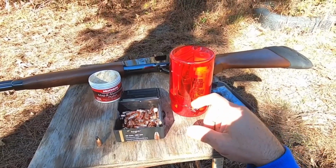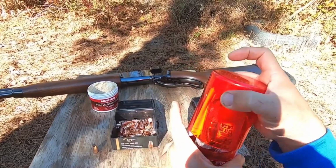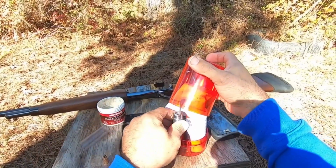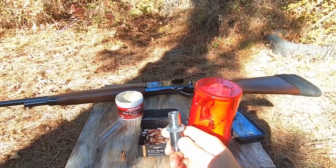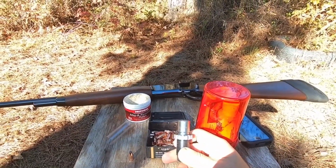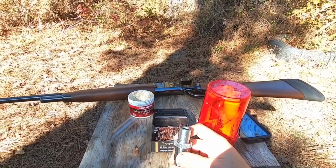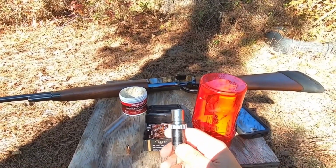Now originally I made one of these. I took a 308 die and annealed it, put it in the lathe and bored it out to 348, and then had to reheat treat it. I did that for the first video. I didn't show the process because it's way too much for most people. So anyhow, I bought one from Lee.